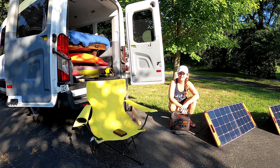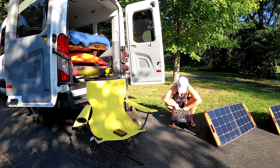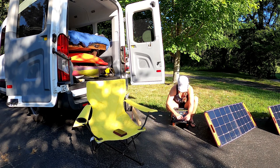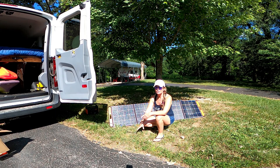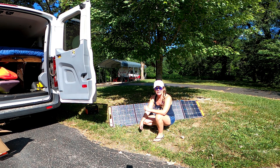We have our two 100-watt Solar Saga panels hooked into the Jackery 1000. We're charging at 109 watts right now with two 100-watt panels. Out of curiosity, let's try one panel — one 100-watt panel takes us down to about 51 watts an hour. So I'm really glad we got the two panels for a little more boost. It's been about two hours since I first plugged in the solar panels, and we are at 48%, charging at about 100 watts an hour. We're still chasing the sun. Quick note: do not leave your battery bank in direct sunlight — I couldn't get the display to come on, so we had to bring it in to cool off for a few minutes. Now we're back to charging.